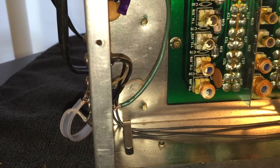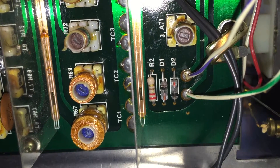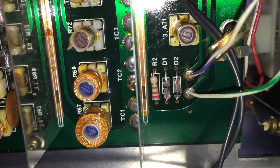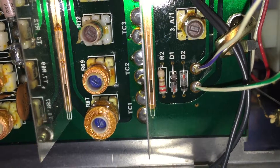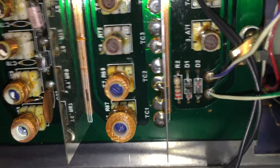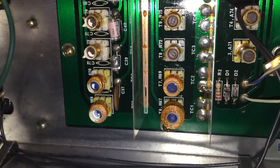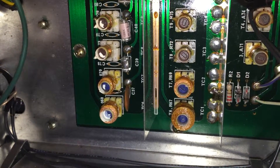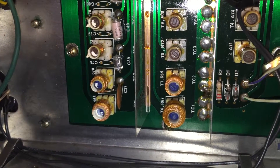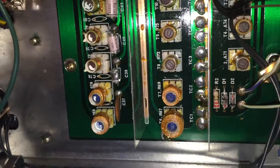I was prompted to look at the schematic by a forum post that suggested replacing resistor R2, which basically shunts the antenna connector to ground to protect against static discharge affecting those two germanium diodes. Somebody had suggested replacing that 220 ohm resistor with a 5k ohm resistor. That got me thinking: in order to increase the gain — they say that resistor decreases gain by about 3 S-units — well, if that's true, then why is that?